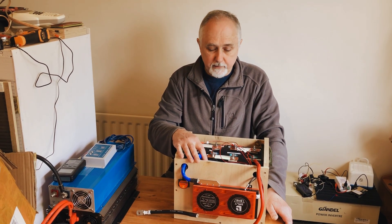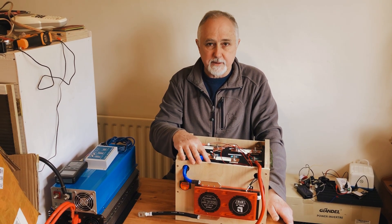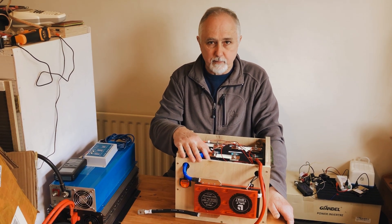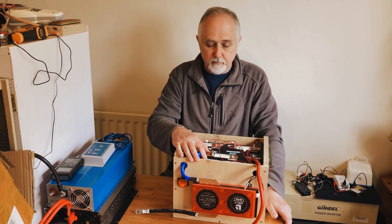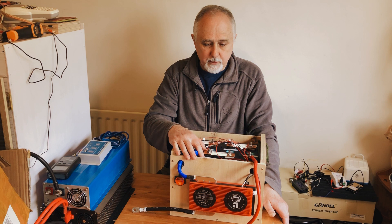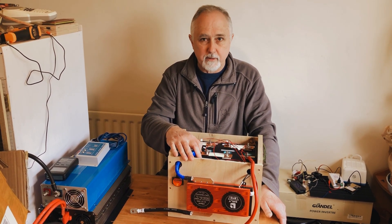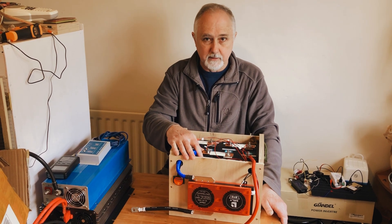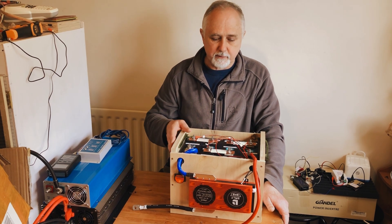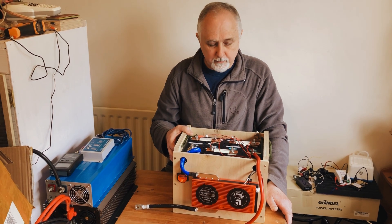That took a long time because, as you can imagine, they arrive at around about 30 percent state of charge — roughly 3.29 volts. To bring them up to 3.65 volts each took the better part of several days: about 20 hours per cell, and multiplied by four that gives about 80 hours on the charger. This process is called top balancing.